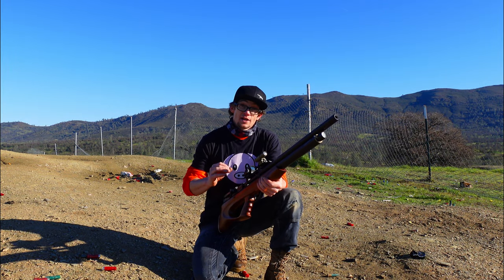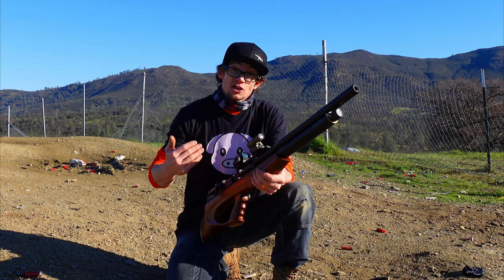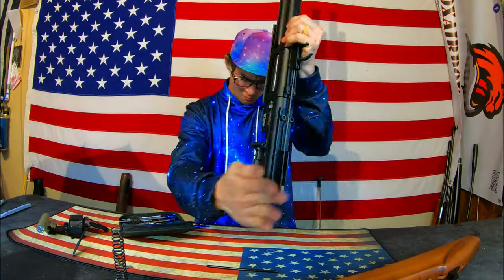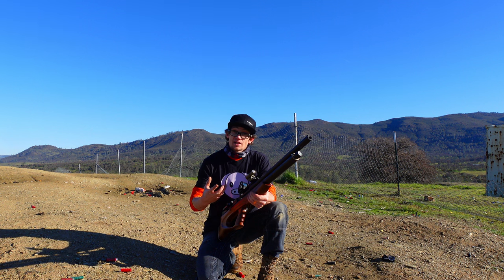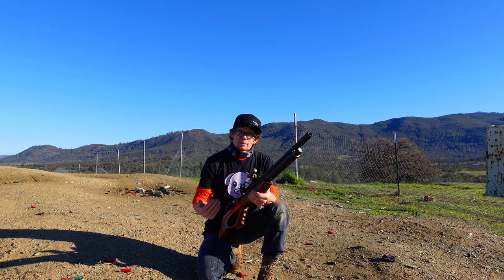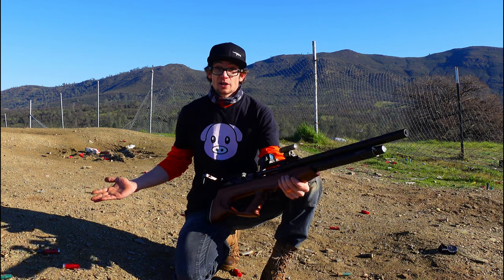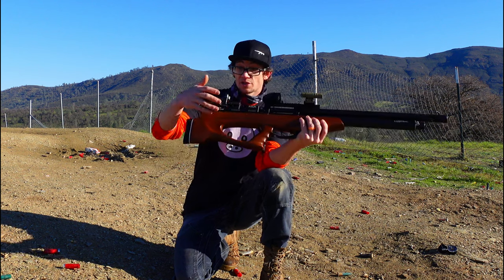Last week it looked like I had one too many washers behind the hammer spring, which prevented me from consistently and effectively cocking this rifle and holding it cocked until ready to fire. I took it back to the home shop, took it apart, figured out what the problem was, and we were able to remediate that issue with no special tools and no special processes — all we had to do was remove that one extra washer. As you can see, this rifle now holds itself cocked with absolutely no issues.